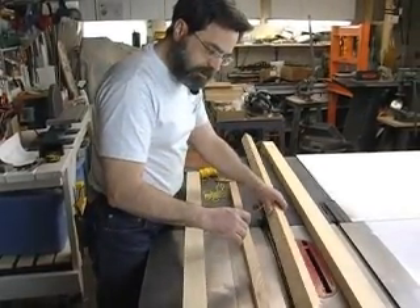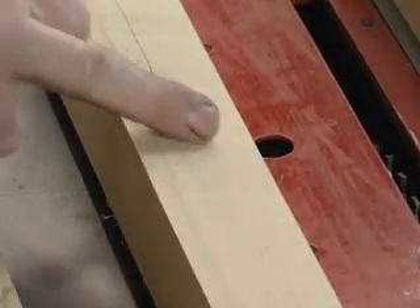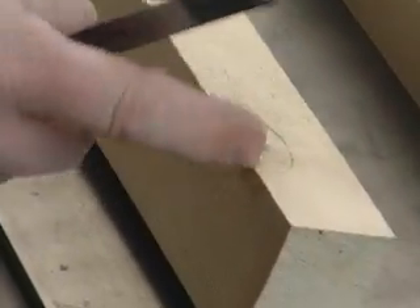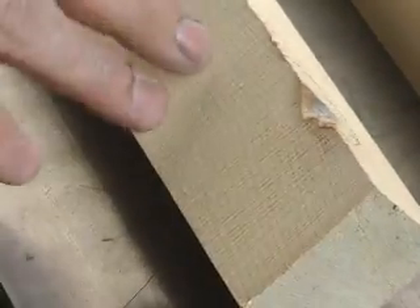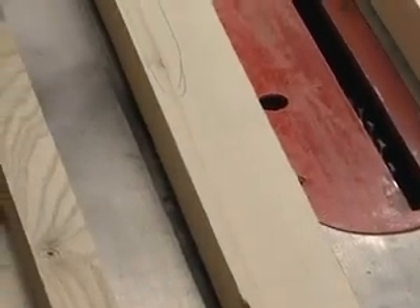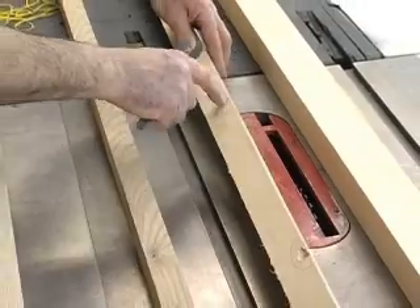This is a piece of spruce I got deliberately to show flaws. It has fine grain for growth, but some really obvious defects. This huge gash is just bad handling at the lumber mill — probably a forklift whacked it. This area is where there was some kind of branch, and not only is it a flaw on the surface, but you can see it causes the grain to diverge. On this side, circled in pencil, is another spot where a branch was coming out of the tree. You don't want these flaws as they mean the structure isn't perfectly sound throughout.